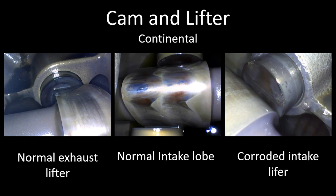That was it for the cylinders. On some engines you can take your AbleScope and work down through the oil filler neck to get a view at the cam and lifters. What we have here is a Continental engine — this is an IO-550 F17, a sandcast engine. It has a short oil filler neck in the left half of the case. All the sandcast engines — IO-470, IO-520 — have that short oil filler neck, and you're able to get down in there and see the first couple of lobes on the camshaft. The left image shows a normal exhaust valve lifter and cam lobe for cylinder six exhaust valve — the farthest most forward on the camshaft. Looking at the image, this is the lifter over here and this is the cam lobe here.